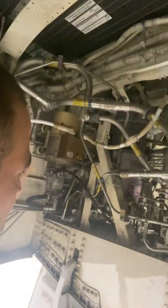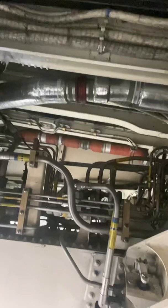Once again, these are tips based on experience. You have your standby electrical system driven by the hydraulic pump. There is a ground cable right here that mounts to the center beam, and you can see we already had a repair done because this ground — there is an advisory from Gulfstream to look for this, and under warranty they will cover the repair depending on the year. If you can see, we had to put a splice here. These will chafe, creating arcing, moisture, and corrosion. They had to cut a piece off and put a splice — another little tip to check for.